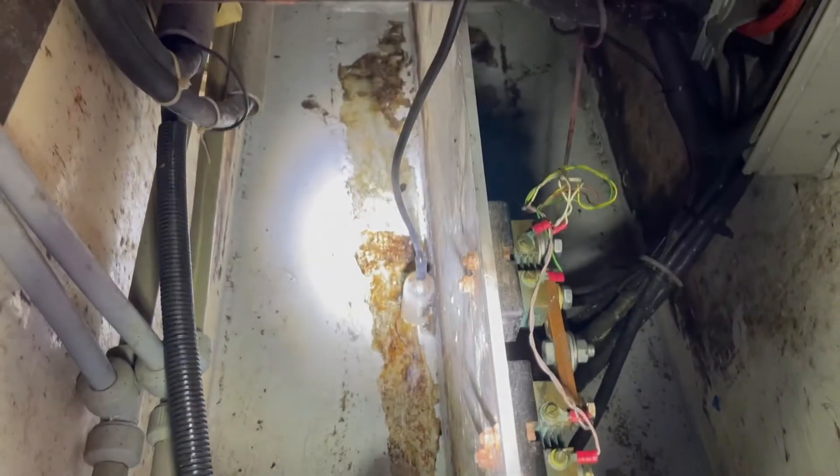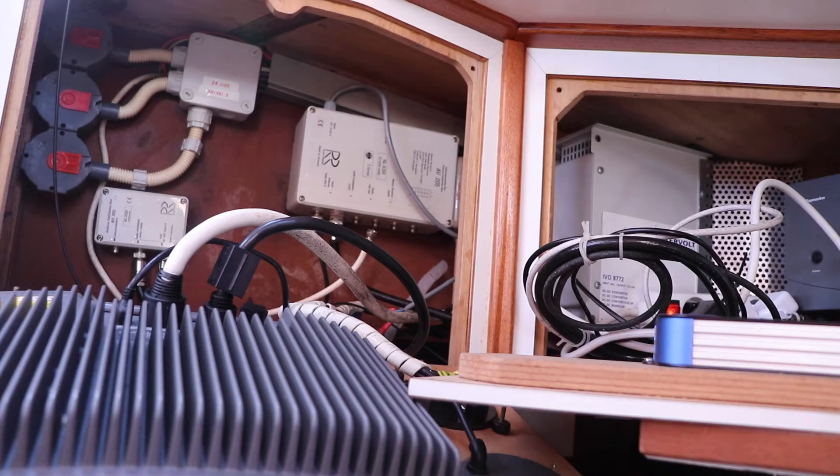In my head I was thinking: if I switch something off, the whole system is switched off. The only thing that could be wrong would be something to do with the shunt or the system before the shunt. But what I did not realize was that I never switched off the minus part of the system. When you switch off, for example, the VHF or the fridge, you basically switch off the plus of the system, not the minus. So all the minuses were still connected, and therefore the light could still light up.